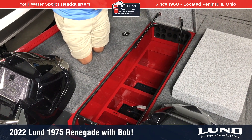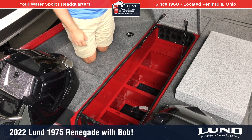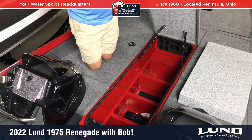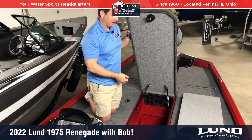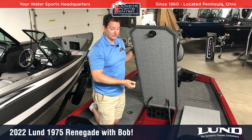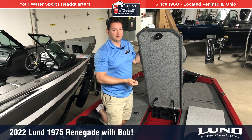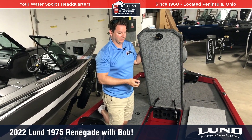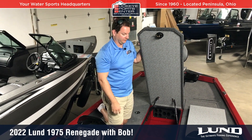Something unique is that the trolling motor batteries are placed in the bow — almost every other bass boat has them in the transom. One thing you'll notice riding this boat is there's very little bow rise, because a lot of the weight has shifted forward. The batteries are a good example of that. The boat is deep enough to accommodate rod storage and batteries up front. Maximum draft is about a foot, so you can still get into shallow water but get a better ride quality from the IPS hull.